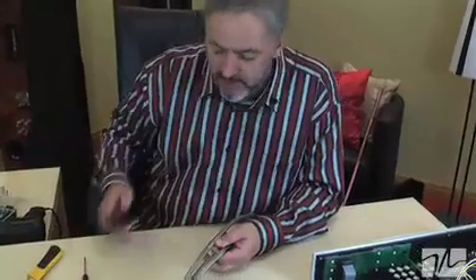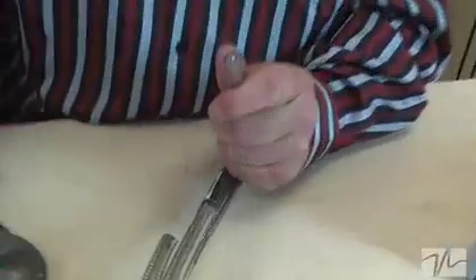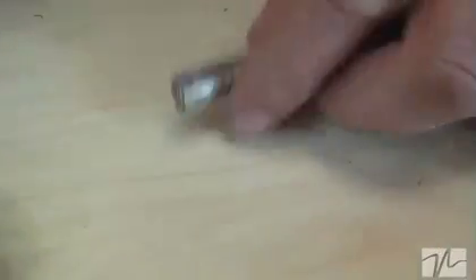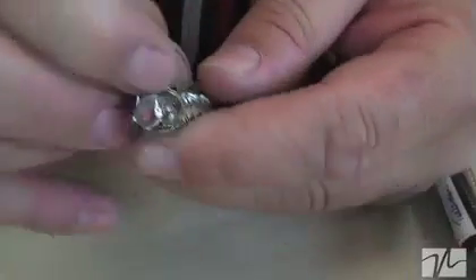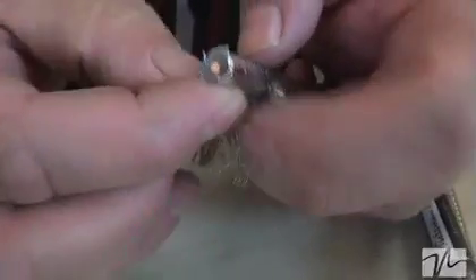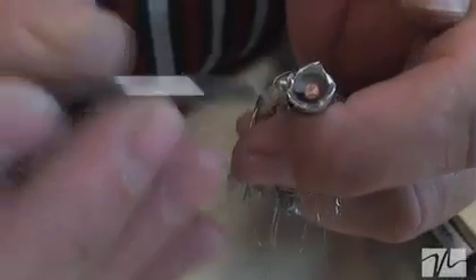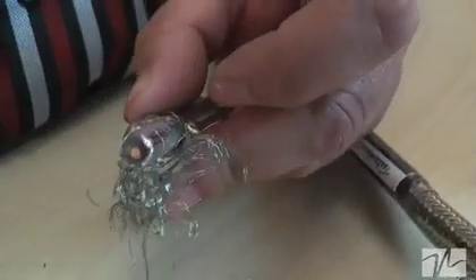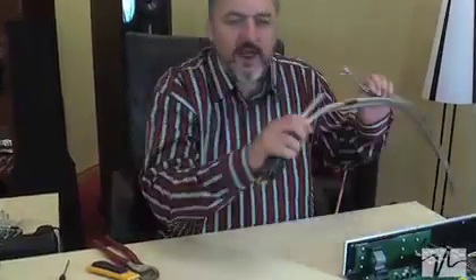As you separately shield the hot, the neutral, and the ground, there's going to be a lot less crosstalk — especially because inside each one is that same idea, kind of like a copper tube, similar to what the Harmonic cable had. This cable has copper and it's tinned copper. Underneath that there's an aluminum cage. As electricity flows through the conductor, the electromagnetic fields are stopped by this fence — we call it a ground fence. This one has both a Mylar and an air dielectric, and as that energy flows through the cable, the electromagnetic fields are stopped. Although this one has protection on all three strands.